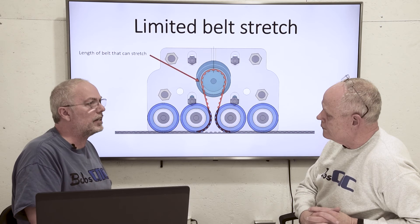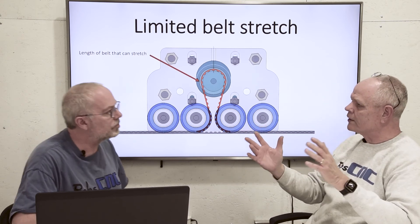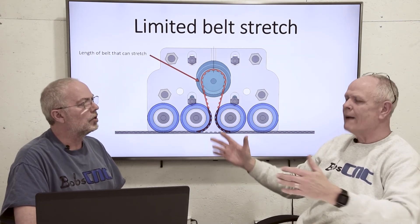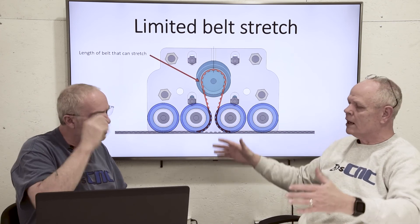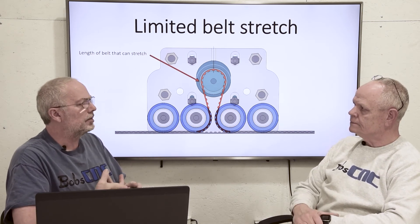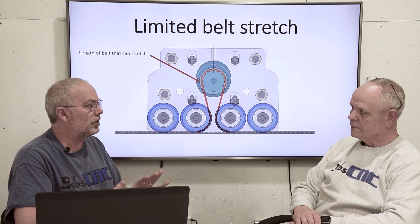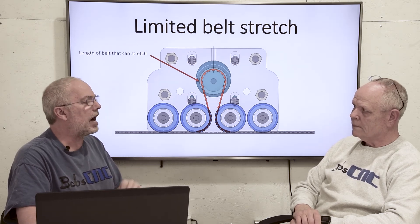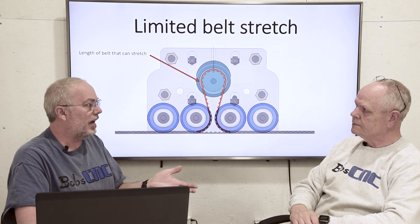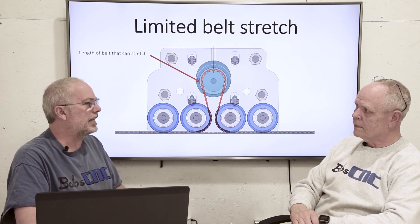What are the practical applications? How does this affect the KL733 and 744? What can we do faster? We actually were testing at 1,500 inches a minute. We had the resolution backed off a little, so we set it to 1,000 inches a minute in our firmware. It's really because of the resolution and how fast the microcontroller can send pulses. The Grbl firmware on an Uno can only run at 30 kilohertz max step frequency. We wanted to stay well below that so we didn't miss steps, and that ends up being a nice 1,000 inches a minute.